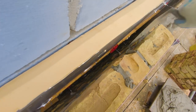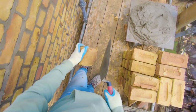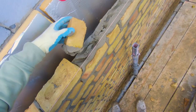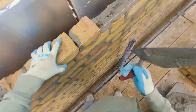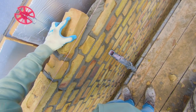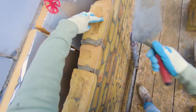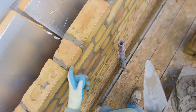I'll show you on the next full one. Some people have told me you shouldn't do this, but I continue to do it — flick muck on the wall. I disagreed with the building inspector at the time, but one thing you shouldn't do is disagree with the building inspector. Anyway, where there's going to be no muck in the top when you put a brick in, what I do is butter the top up, scrape it down on either side like so, then butter up as normal. Put it in, load it down — you've got muck in the top. Then flick and push on the top: push it in, flick it down, push it in, flick it down. When you come to joint it there'll be plenty of muck in there. There's also a tool called a tuck pointer you can use to push the muck in, and that works perfectly fine too.